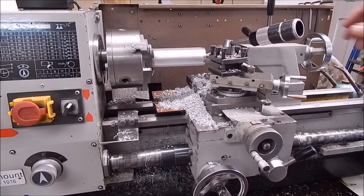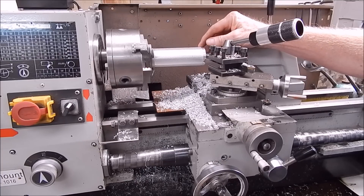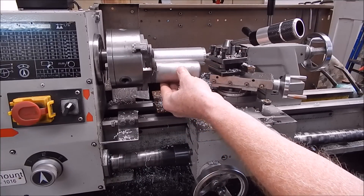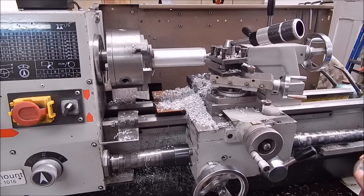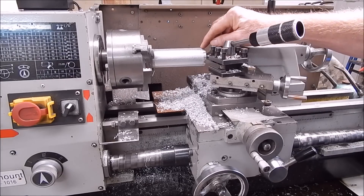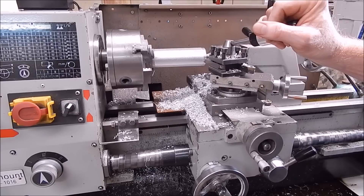Here's that piece of homebrew aluminium which was melted down scrap alloy from various things. It started off looking like that — it's another piece which I did. It's easy to do; just look at my videos on how to do your own round stock aluminium. You don't need a lot of expensive equipment — you can do it with a wood fire, there are various furnaces you can make up, and they all work well. I've started a cut and thought people might like to see how this works on aluminium, so I got the camera out.